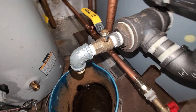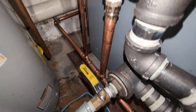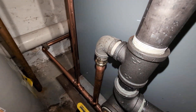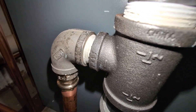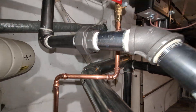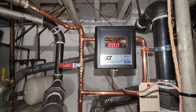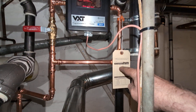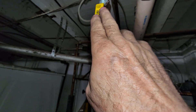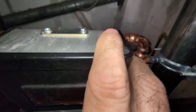We've got a proper drain-purge drain there and a regular drain here. We've got it connected with a brass pro press, then a stainless steel close nipple, and that's our water feed. We pro pressed that, and there's our VXT flickering. We've got the maintenance tag here ready to go, mounted with these caddies. There's our backflow preventer, shut-off, manual bypass, and of course there's your feed there.